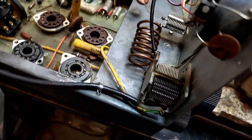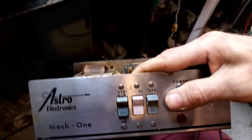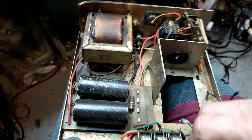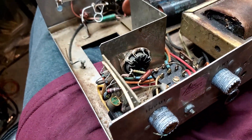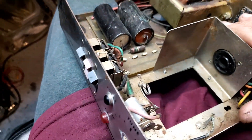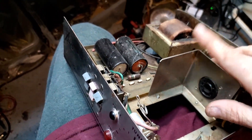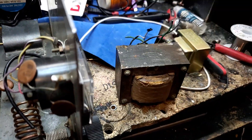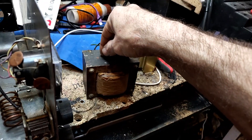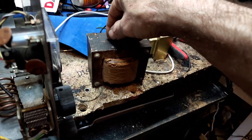I'll show you what I'm taking it out of — this is an old DC Astro. We use everything but the squeal around here. This little bracket right here houses an eight-pin octal socket, and it's in a very cool little DC circuit which is not wired exactly the same as your Firebird. I'm going to take this guy and put him in here. Now I have two eight-pin octals — I'm going to put a 6LQ6 in each one of them and power those 6LQ6s with another power supply.